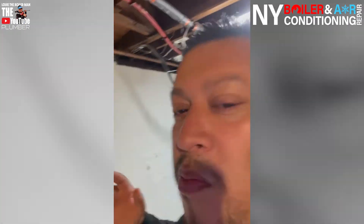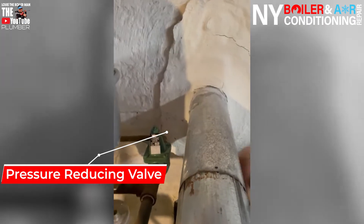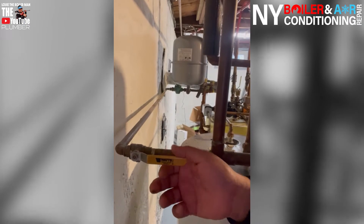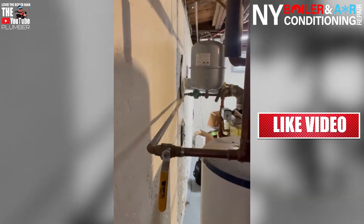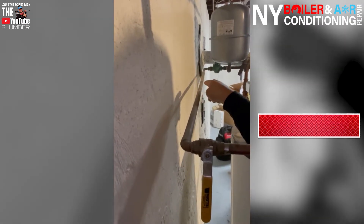What causes the pressure to go up is the pressure reducing valve or feed valve right here. In this particular case, it's a half inch Taco feed valve or pressure reducing valve. You want to make sure this is off — the feed is coming from this side. We want to make sure there's a valve we can shut off. In this case, we found one right here. You notice this valve is in the open position — it's parallel. Now we turn it like this and the valve is closed, so there's no water heading to the valve. After you close the valve, you're going to drain down the boiler to get the pressure down. We're going to remove the water and you'll see this gauge actually going down. When it gets to zero, it's safe to remove the expansion tank and start doing your job — remove the bleeder and the relief valve.